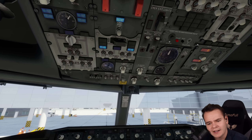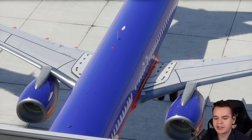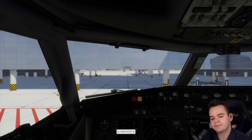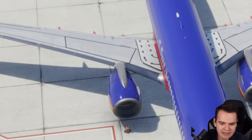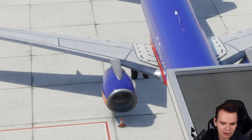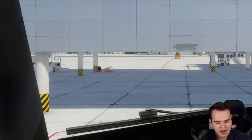So let's go ahead and do that. Let's open the valve. We've got pressure here, as you can see — duct pressure. And that should give us enough air to make those engines rotate to 20% power. This is how it works: we just press the ground switch here, and now we can see that air is slowly starting to prepare that engine. That is working — the air start unit is doing its job.